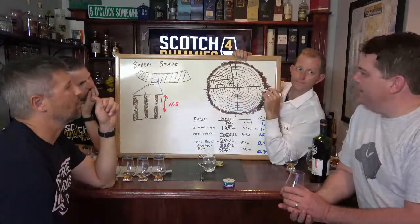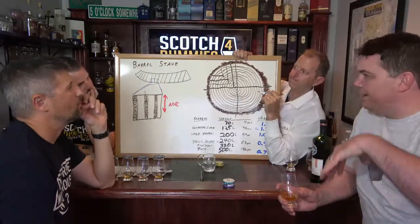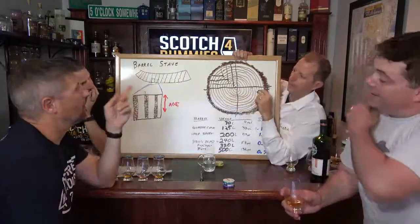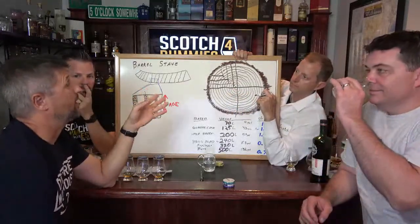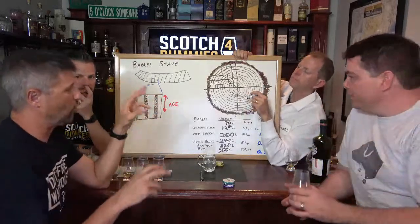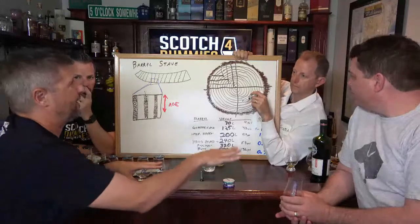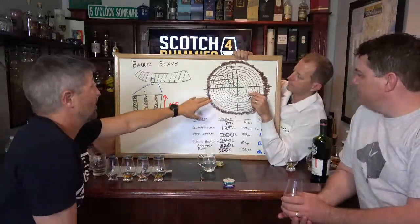So you're trying to maximize the number of capillaries in that stave running in, so you have to cut it that way. Consequently, you can see a really good example of this in high-end furniture like tables and oak tables where you see quartered oak and you get this almost tiger effect in the wood. And that's why it's so expensive, because you're wasting actually a lot of wood.